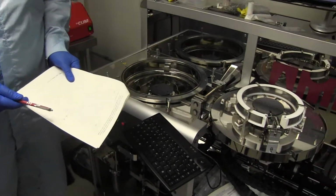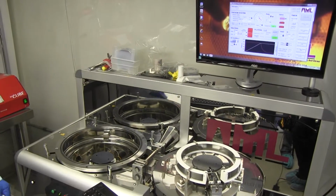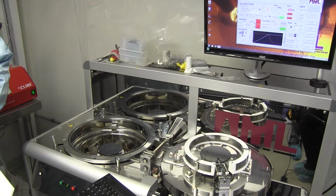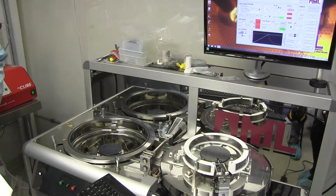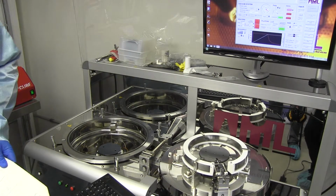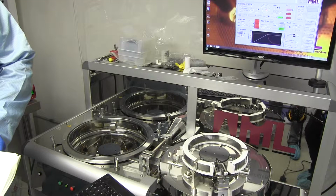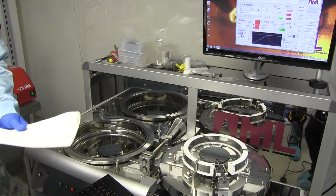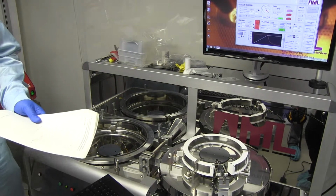gas. So if we've used water injection, we're going to have a lot of moisture on the surface, and we're going to generate quite a lot of gas. So if you have a textured wafer with escape paths for that gas, it'll be fine. If you don't have any escape paths for it, it basically is going to create bubbles, and you'll have voids in the bond. So hence, it's all a trade-off between bond strength and voids.